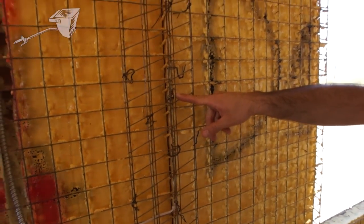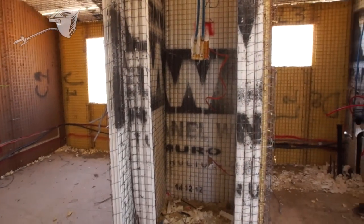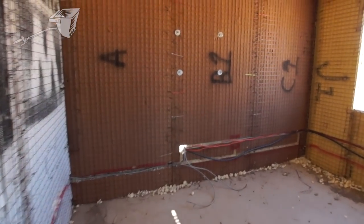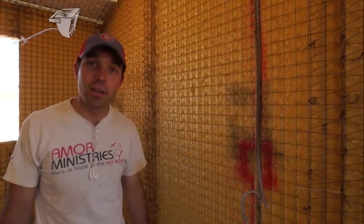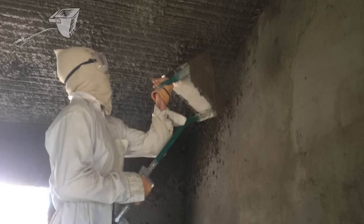After the walls are up — and a similar process for the roof — once the roof is on, we will run electrical wire and put in wire and boxes. After the electrical and plumbing is in, we'll go ahead and put two coats of stucco on the interior walls. After the slab is poured on the roof, we shoot the ceiling with a mortar sprayer with stucco.